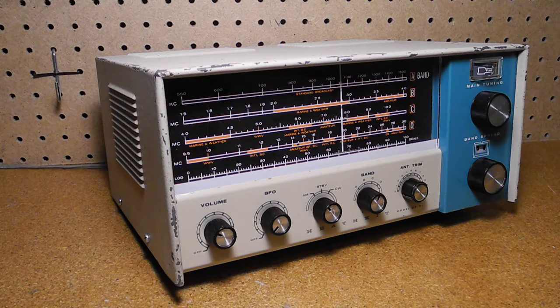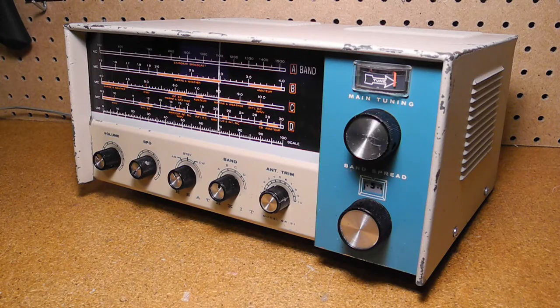There was no 220 volt wiring option. It uses a 455 kHz IF frequency. Neither the manual nor Heathkit catalogs publish specifications for sensitivity or selectivity, but performance is comparable to similar receivers of this era. It can be aligned with or without test instruments, and like most Heath products, it was sold only as a kit.